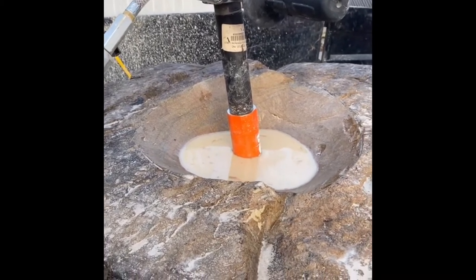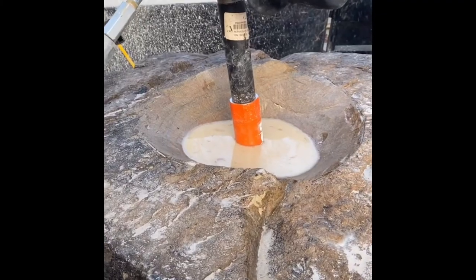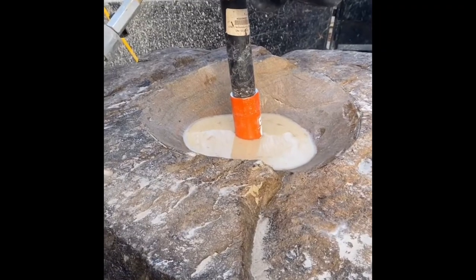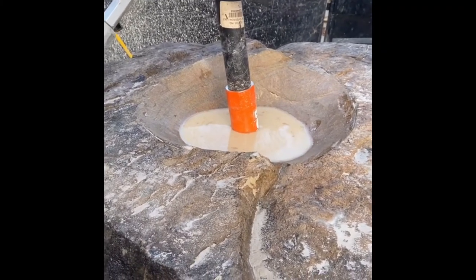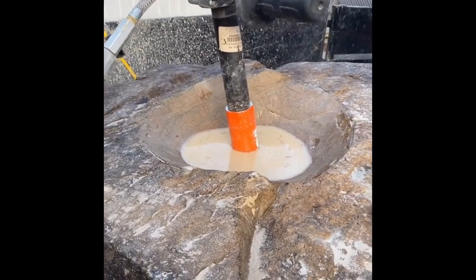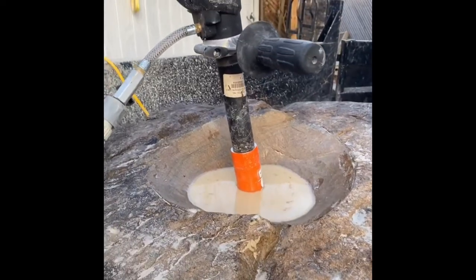My bit's starting to slow down a little bit now. I actually called the company and told them exactly what type of stone I was working with and they had a special diamond bond bit for this specific stone — so that's important depending on what type of stone you're using. Sesco Tools is a great place to find core bits and drills for all your boulder fountain projects. And now we're heading out to install this fountain on this cold November morning.